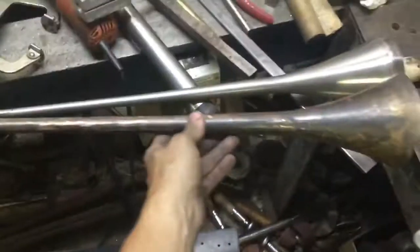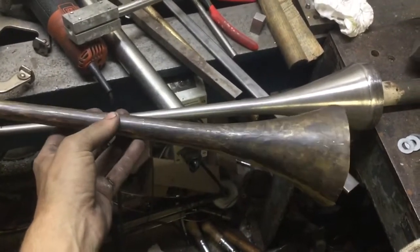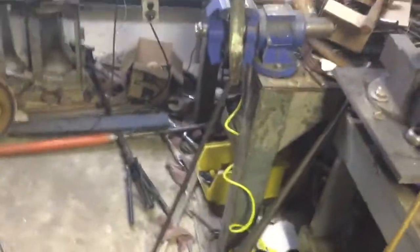All the blanks are identical and I'm not spinning on this or drawing these — I'm just burnishing with rollers and hammering the flare, which gets me a consistent result that goes into the lathe for inside spinning. When the time comes to fit this to a mandrel, the tail is already perfectly round and the flare is on the same axis as the tail. It's saved so much time and failure — I've got a whole stack of them done. The reason I'm talking about this is I need to make one for my French horn pattern, but that's a much bigger mandrel and I don't have the steel for it.